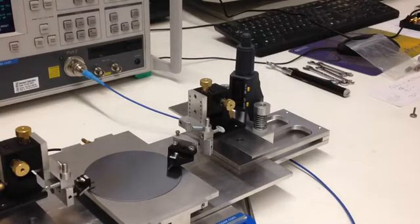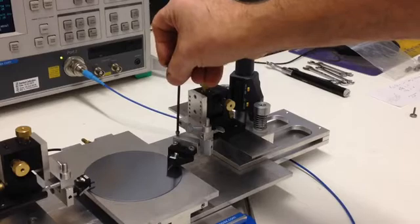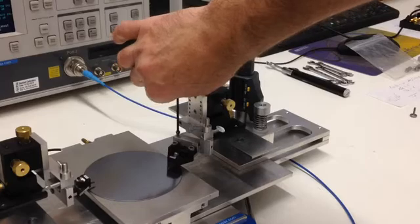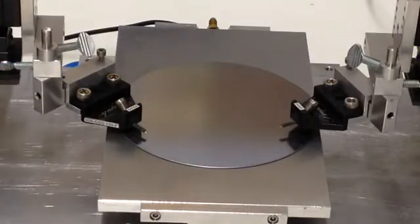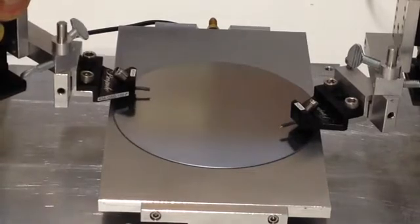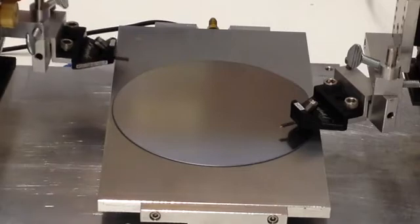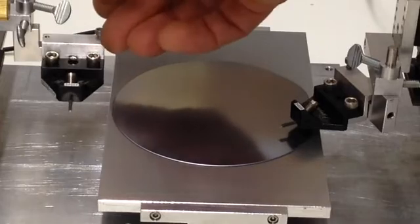And to further the adjustability, each arm has a planarity adjust. So you put an Allen wrench in this and the probe can be replanarized. So these positioners can be relocated and the thumb screw loosened, and it can be continued to be rotated further still.